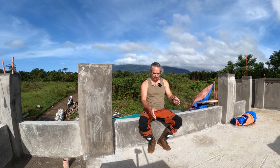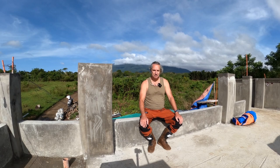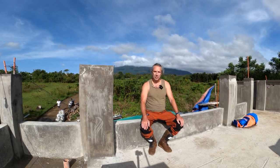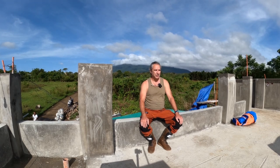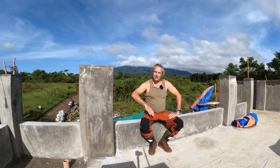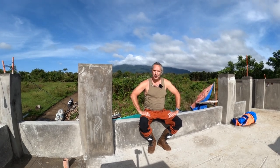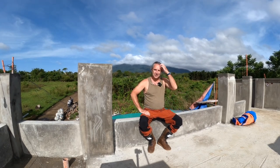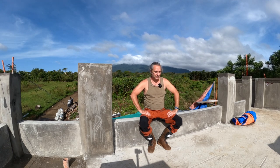We dug a sump pit directly in the center of the floor downstairs. It's about almost a meter deep and probably 18 inches wide square with a gravel bottom. And we're gonna plumb that for electricity so we could put a 1 horsepower water pump inside of it that has a float, so it's automatic, and that will pump through a PVC line directly into the box culvert. And then our third line of defense is a French drain around the inside perimeter of the first floor, which also will drain into the box culvert.